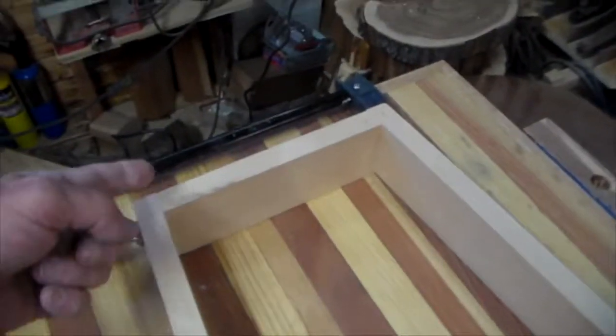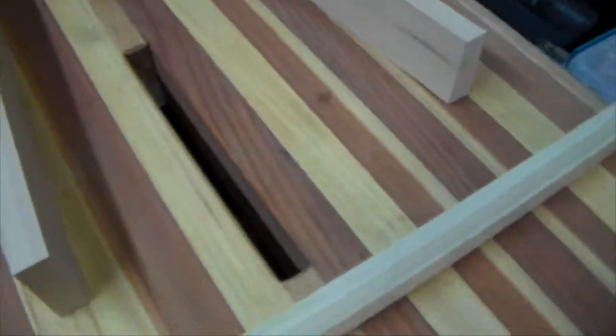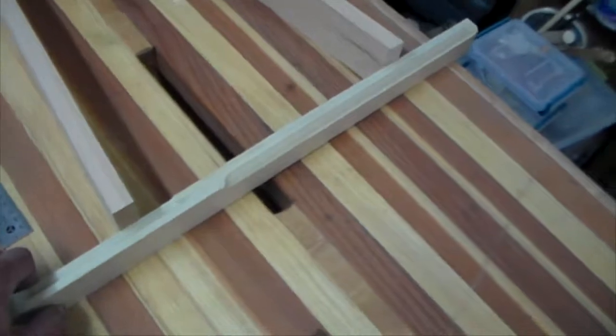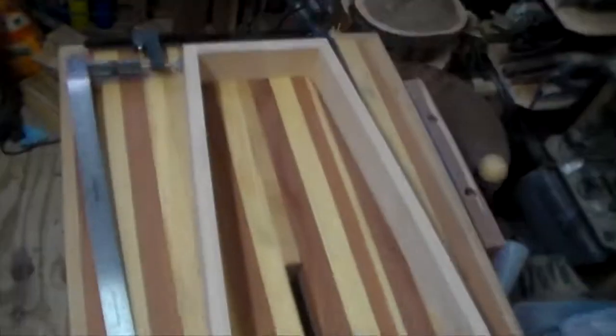It's a 5-degree angle here and here. And that's about 9 inches across. That's the top, and that's where I wanted to mount to the table. And I wanted to splay down our end between 12 and 14 inches. 5 degrees, this would be the ground. And we would have about 12.5 inches, so that's gonna work out for me. So that's basically gonna be one of the legs.